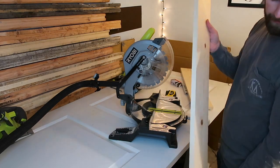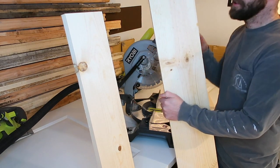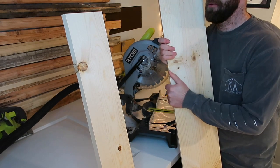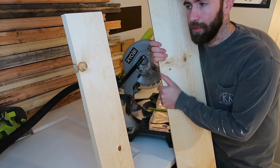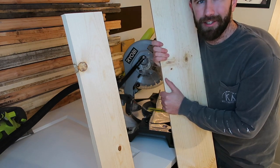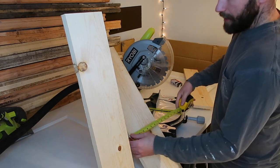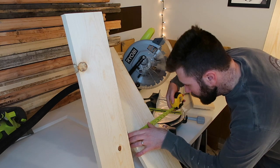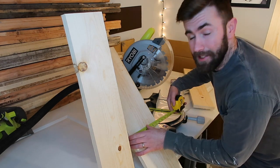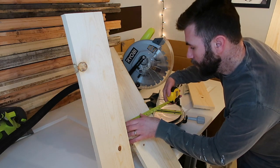Now that I have my five and a half foot piece cut, the 1x8 pieces are going to be the top of my mantle. For the side pieces I want them to be just as long as the 1x8 is wide. Now you're thinking 'one by eight — eight inches' — but if you measure any piece of wood from Home Depot or Lowe's, even though the tag says 1x8, it's really like three-quarters by seven and a quarter or seven and a half inches. So you definitely want to measure your pieces to get an accurate cut.